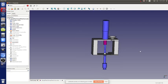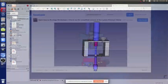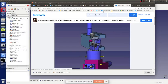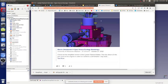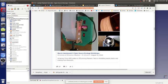How much plastic can it go through? The former one that we did here was a spool in 2 hours. That was with a half inch. Here we could probably go a bit faster with the 1 inch and more heater bands. Here it's like one little heater band, I think about 250 watts or so at the tip.